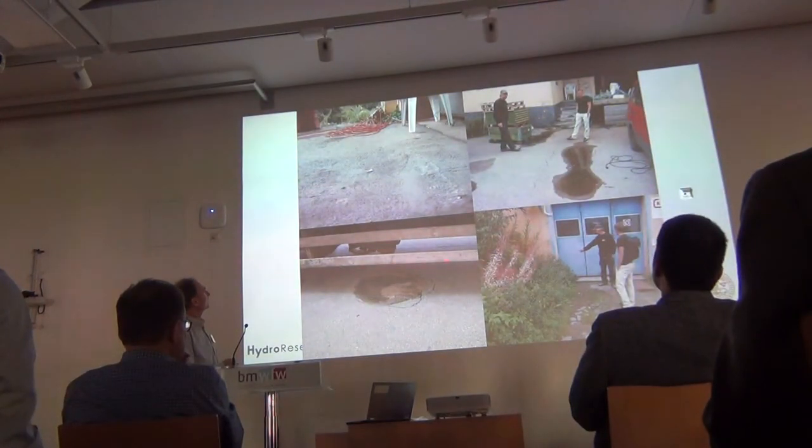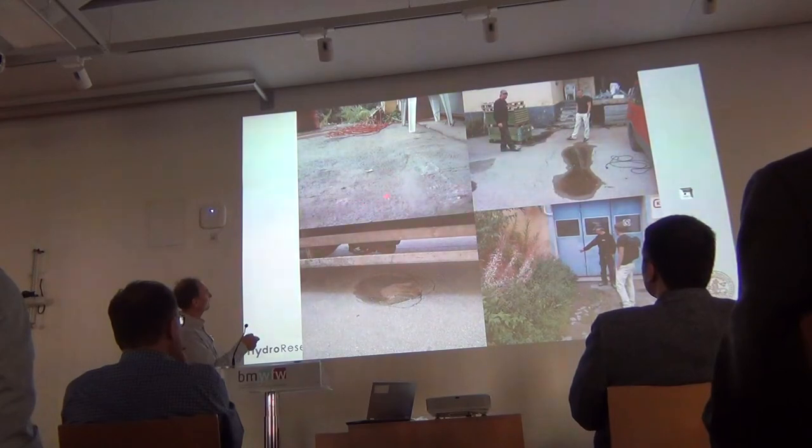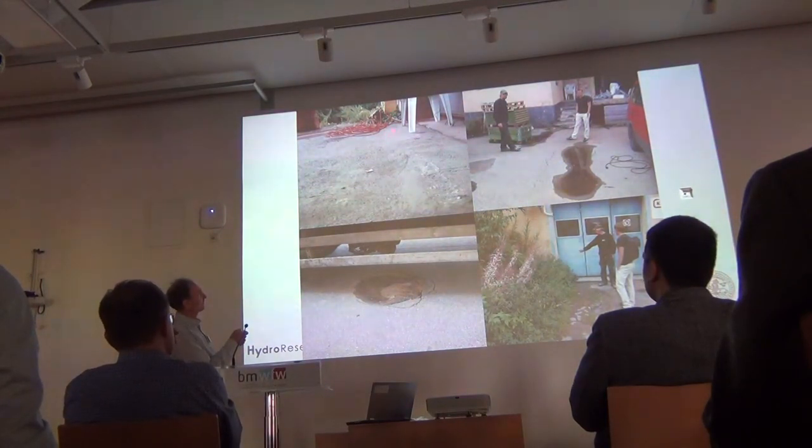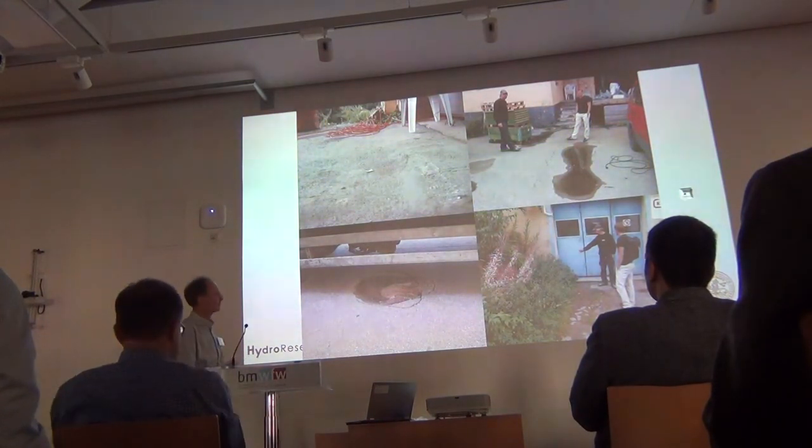These slides show signs of internal erosion, settlements, features like this and like this, leaking out here. There were actually cracks in the building, and our conclusion was that a lot of the problem came from direct leakage into the building through cracks. The situation was clearly not quite satisfactory.